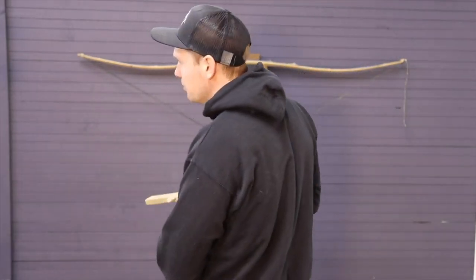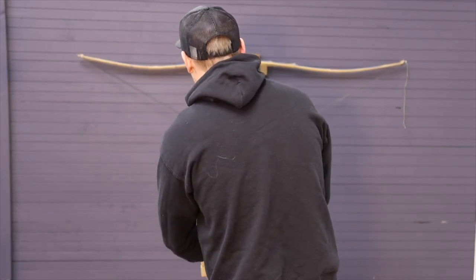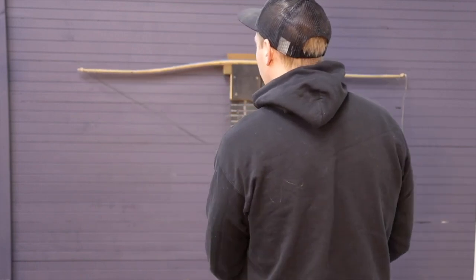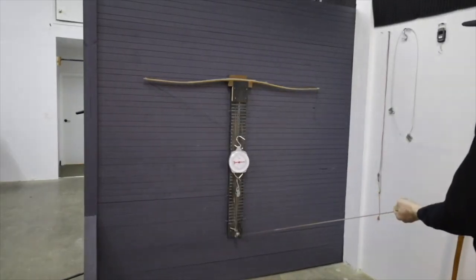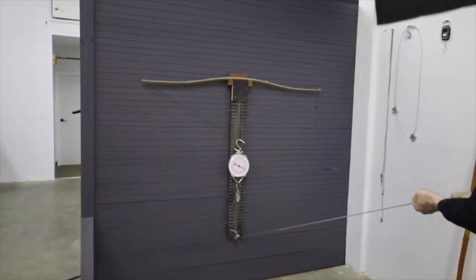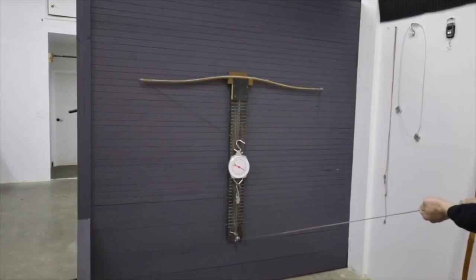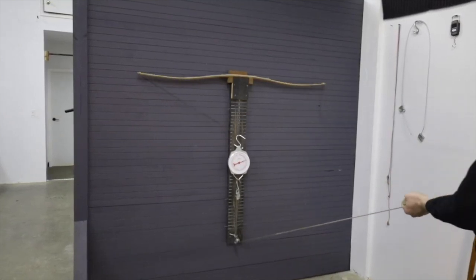So before I check the bend on this bow, I'm gonna exercise the limbs here for a couple minutes, and I'll warm it up. Okay, we're making really good progress. I removed quite a bit more wood with the belt sander, and then we're bending about 4 inches now from its resting state. The limbs are bending down 4 inches. And now we're gonna head over to the scraper.